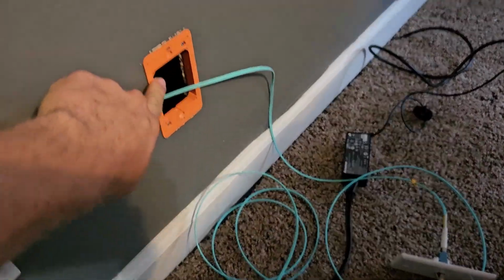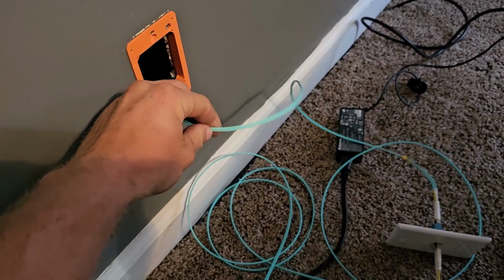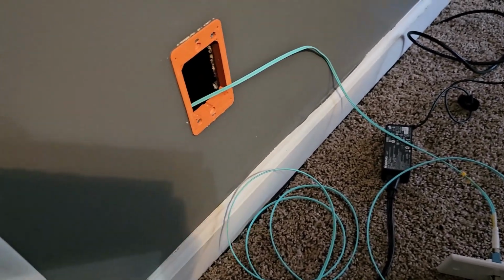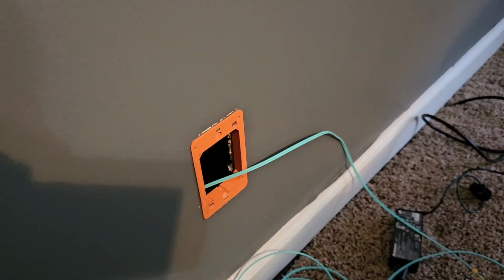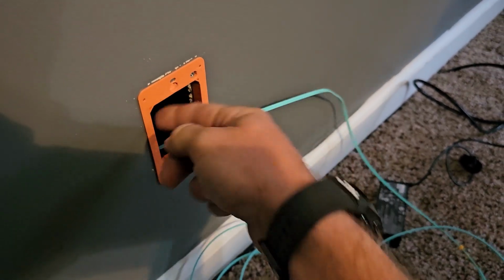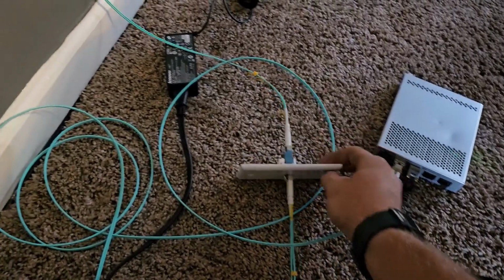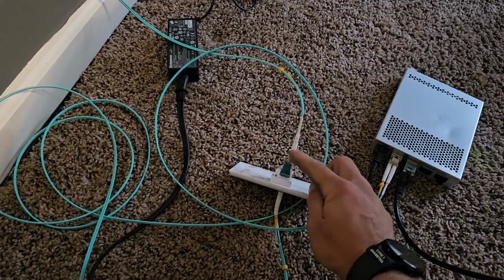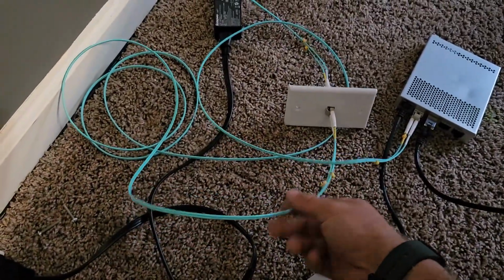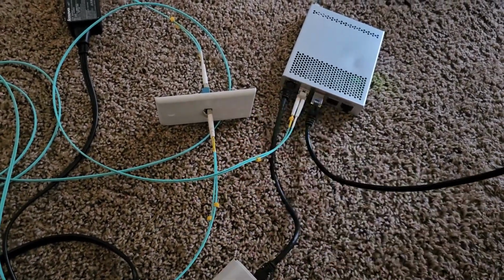And then what I did was I cut a hole in the wall here, added this work box, and then this fiber here. This is a pre-made fiber that I bought off of Amazon. I think it's like 100 foot, and you can't really see. Maybe if I shine my light in there, no, you can't. But the excess fiber, I just shoved it in the wall because this is a cubby underneath my stairs. And then for the faceplate, I got a fiber coupler, and then this pre-made fiber, I just ordered another short pre-made fiber. This is the slack for it, and the short pre-made fiber goes into this SFP+ module.